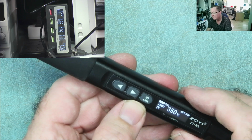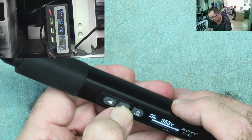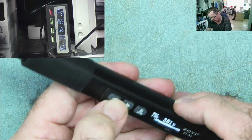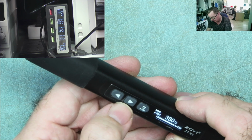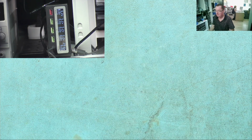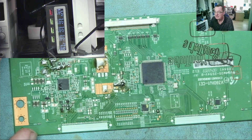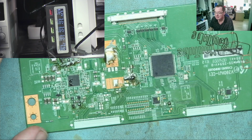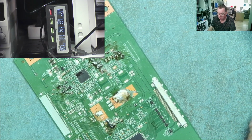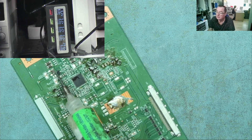So while I was in the settings, it obviously went off. Yeah, this just turned the temperature up. So normally I have my soldering irons about 380 for SMD work. We've done that. Let's see. So my scrap board, I've tested so much stuff on this now, I'm surprised anything left on here really. Okay, we'll try one of the large capacitors. This one will do.